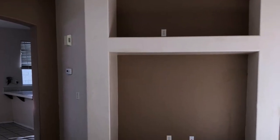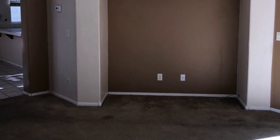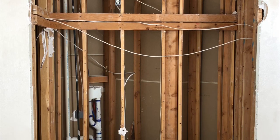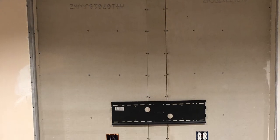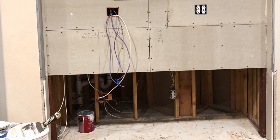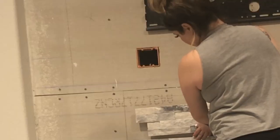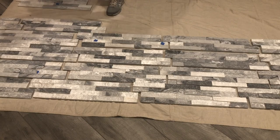I am back with another exciting DIY video. When we purchased our home, we knew we did not like the outdated style of this entertainment wall. I knew I wanted to add some natural elements to our living room and figured what better way than adding some beautiful natural stone to our entertainment wall to help elevate the space. The first step was to demolish the area and remove that awkward mantle in the middle. We reinforced our wall by framing it with 4x4s and adding cement backboards to hold our stone.